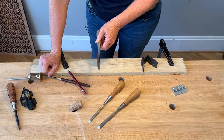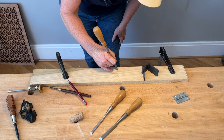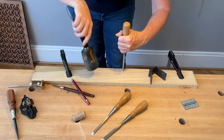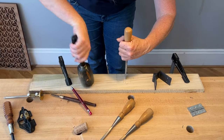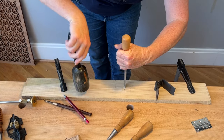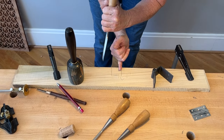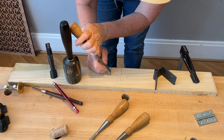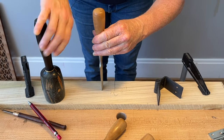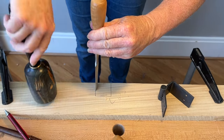With the knife in the lines around the hinge leaf, I want to deepen them slightly with a chisel before I get started. I'm going to put the flat side toward the keeper, the bevel toward the waste — as almost always. I forgot to mention my mallet earlier, but I do need it — I'm not strong enough to just muscle through this. I'm only deepening this a little bit; if I were to hit it really hard, the bevel could force the chisel over the line and I'd have a somewhat sloppy fit.